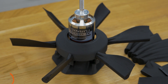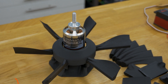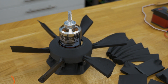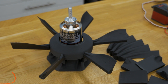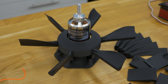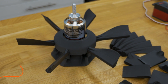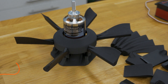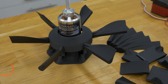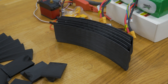The cage has angled arms, and the reason for that is to help compensate for the torque created by the propeller. Normally, when you increase throttle, the weight and inertia of the spinning propeller causes the entire paramotor to turn violently to the left or right, depending on the motor's rotation direction. The angled arms should help counter this — it's already tested and proven to work in principle, but you need to test it for your specific situation. You can play around with the angle and size of the fins, based on some simple calculations combined with some educated guesswork.